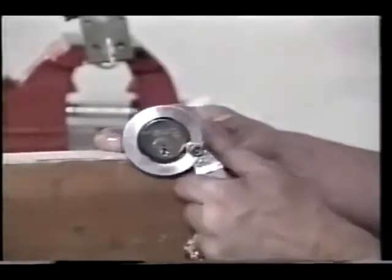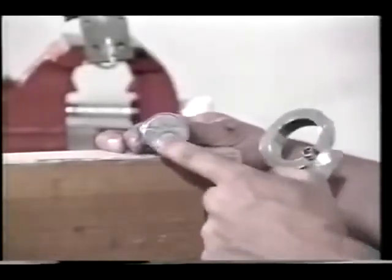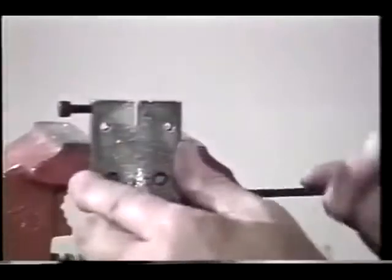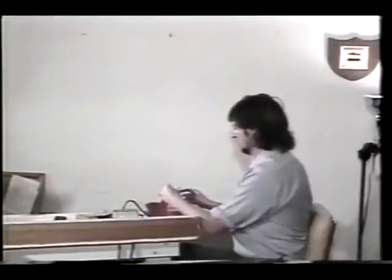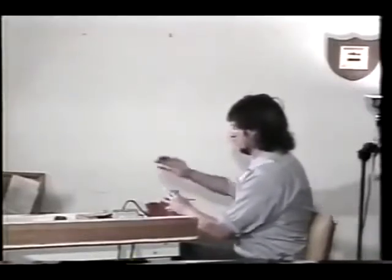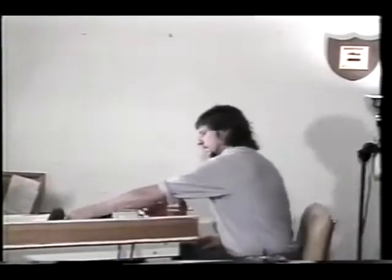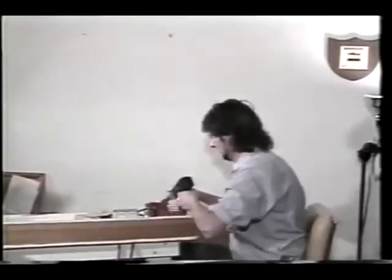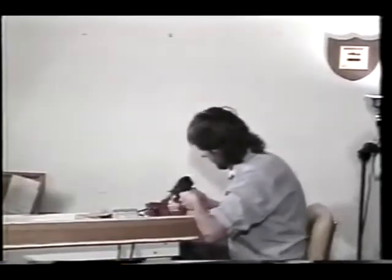Third fastest method, drilling. No, not drilling the cylinder. These are very high security hard plate cylinders, very difficult to drill. There's an easier way. This is a new drilling jig on the market. To use it, you simply put a blank or a cut key of the same type in the lock. We're using a Schlage here. Adjust it so the rig can fit down over the key. Tighten the rig on the key using its Allen wrench. Take a drill, use the rig as a guide, and drill into the set screws of the lock.